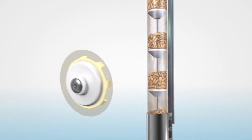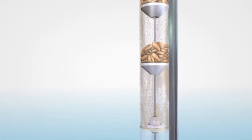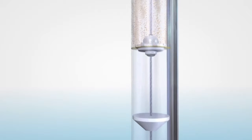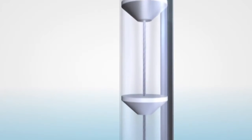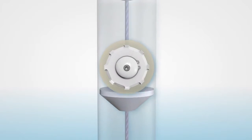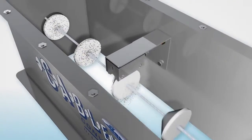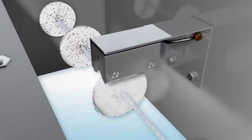Additionally, our systems use a replaceable urethane wiper disc mounted on the cable that acts as a squeegee and sweeps fines to the turnaround unit each round. The wiper is a larger diameter than the tube, making it easy to remove any material left inside the system. Air knives are used to blow off debris at specific points where fines might accumulate.